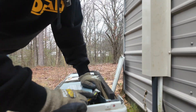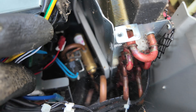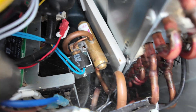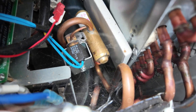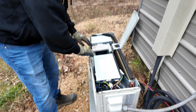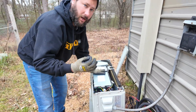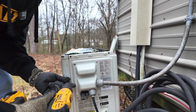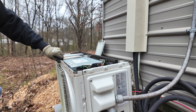Now if you look down into the top of the unit you can actually see the reversing valve — see that valve there, and the blue wires that go to this black solenoid? That right there is the reversing valve. We want to take the front panel off now so we can see where our plug goes to our main controller or inverter board.